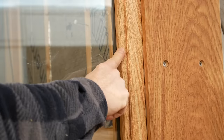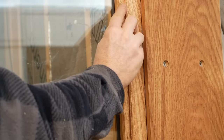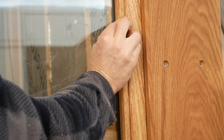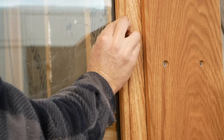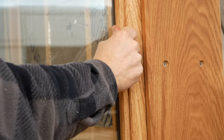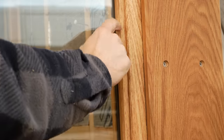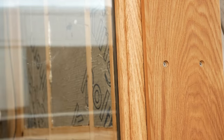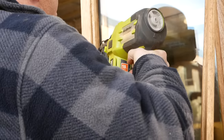That's it tight against the glass, and I'm looking at putting a 1mm black tape in there, so we're looking at something like that. If I put that 3mm in there, you end up with that sort of gap, and it's just a little bit more. I kind of need that bit of a reveal on this frame. Chamfer city, really, isn't it?